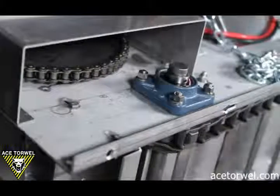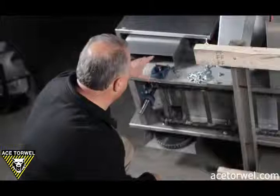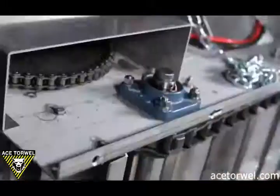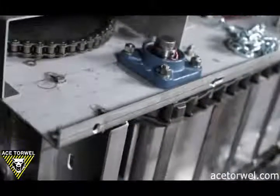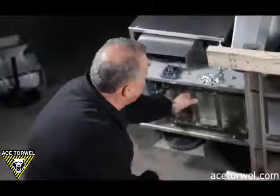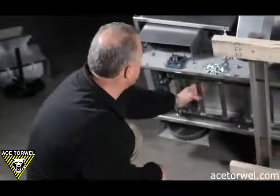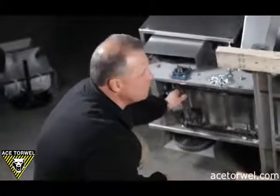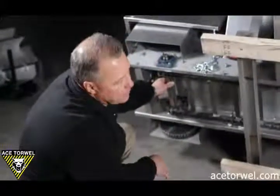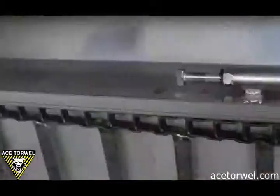Where the drive shaft is, where the drive sprockets are — we have a 1 inch shaft supported on both sides by two 4-bolt bearings which have their own grease fittings. To the shaft we add two 8 inch cast iron 8-2 sprockets and then the self-cleaning pintle chain that gets attached to the front and rear of the conveyor system. It runs up through the hopper and delivers the sand out the back of the hopper.